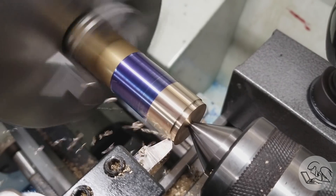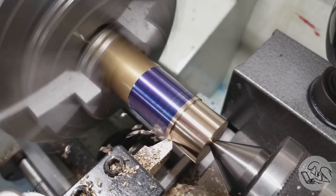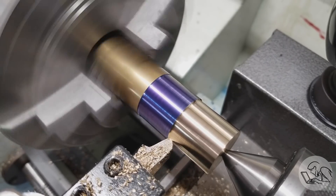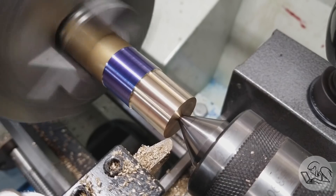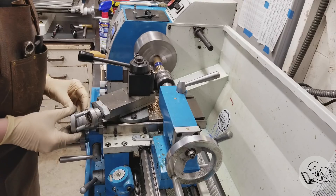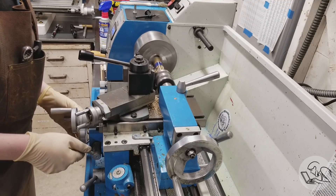Now we can mark the edge of the knob and we've got to turn the shaft area — where the threads are going to be — down quite a bit. While we're doing this I want to talk about this tool bit. It's one of the first tool bits I ever ground, and you can tell by how poorly made it is, but it actually works very well on brass. It's got a very generous nose radius, the top rake is flat as for any brass tool, it has a clearance angle cut on the back so I can get in close to the live center, and a generous lead angle at the front. All of these combine to leave really quite excellent surface finishes.